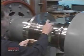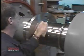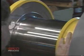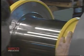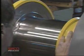Prior to masking, this journal and adjacent surfaces are solvent cleaned to allow proper adhesion of the masking materials. The journal is masked off using a combination of aluminum and vinyl tape. Since the plating solution will only contact the surface being plated, masking is minimal.